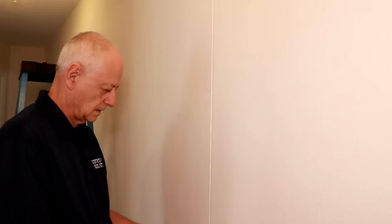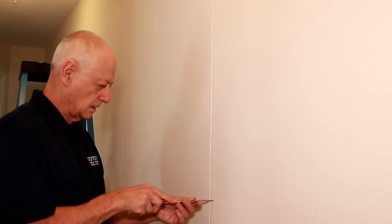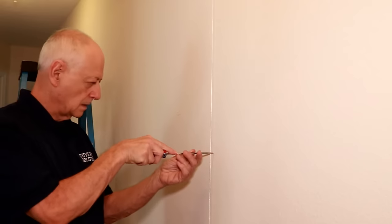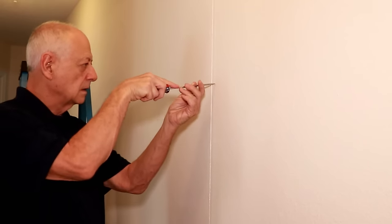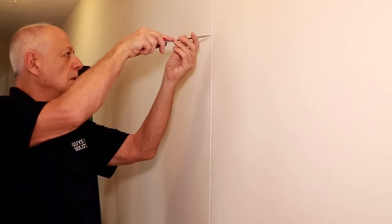That is the reason why so many professionals also miss galleries in your walls. While you have that string up, take a screwdriver and try to push it up and down the entire length of the stud about every four inches. If the wall feels soft or if the screwdriver pokes right through the drywall, then you could well be looking at a termite gallery.